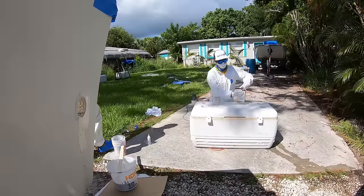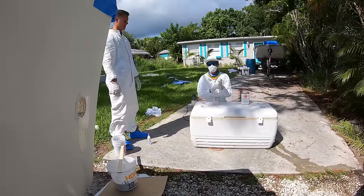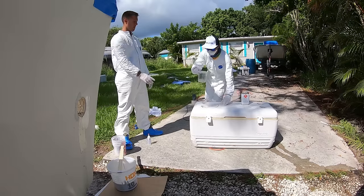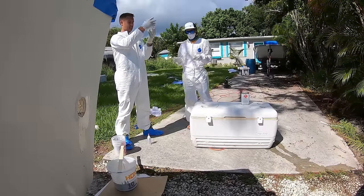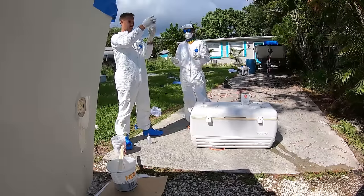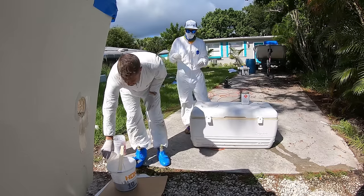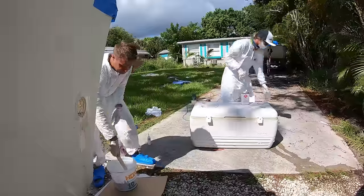We're gonna do 4 ounces of black solution per gallon of paint. And then we're gonna make batches of it. That way we can do it all real quick because the paint hardens and dries fast. So we need to make batches and then set them out and then add the hardener as need be. So we just added in the wax to our gallon of paint.